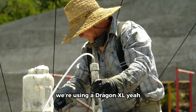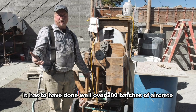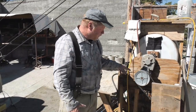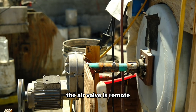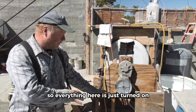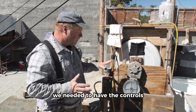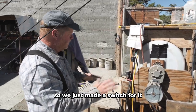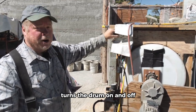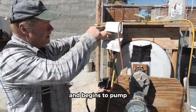We're using a Dragon XL — it's on its third summer now and has done well over 300 batches of aircrete. We've changed things around a little bit. Because of its location, the air valve is remote as well as the electrical switch. So everything here is just turned on, but we control it remotely since we're up here mixing. We just made a switch for it — the first one turns the drum on and off, the second one turns on the Dragon XL and begins to pump, and we have a remote switch to turn the air on from our compressor.